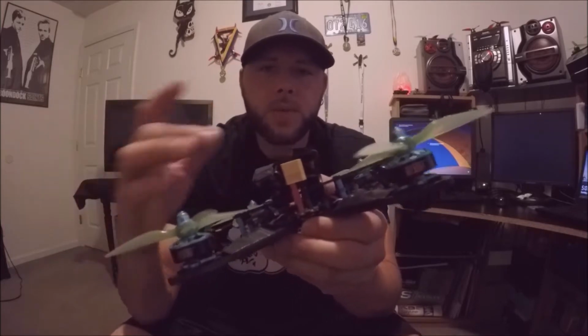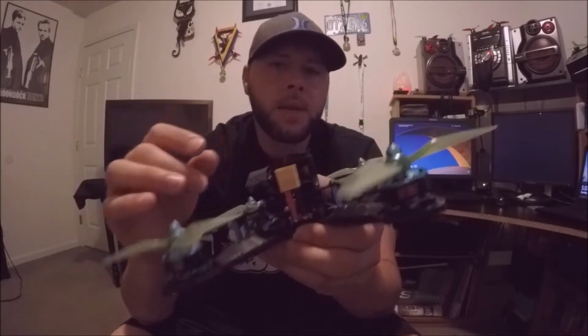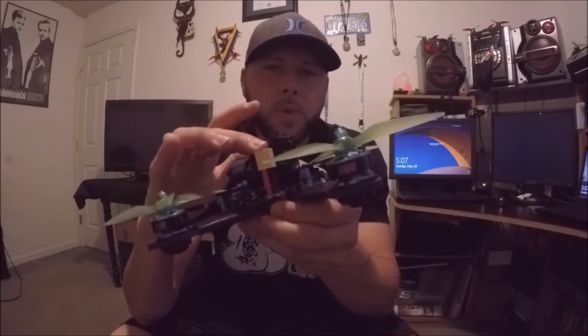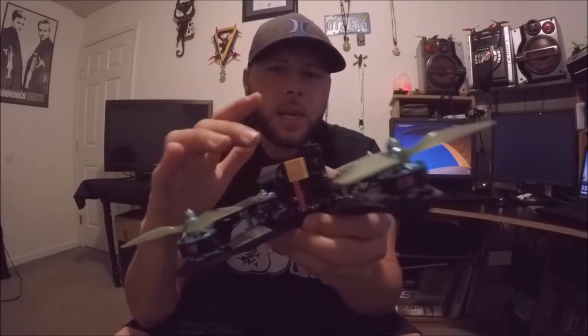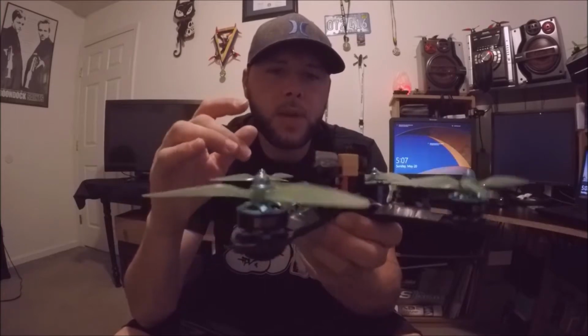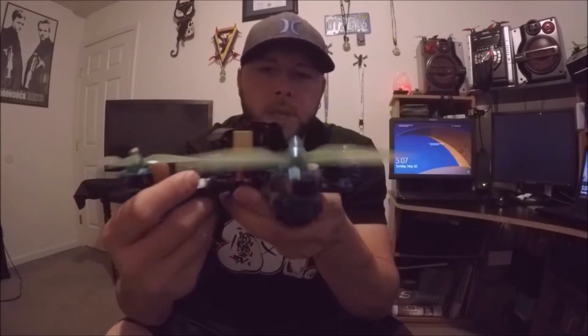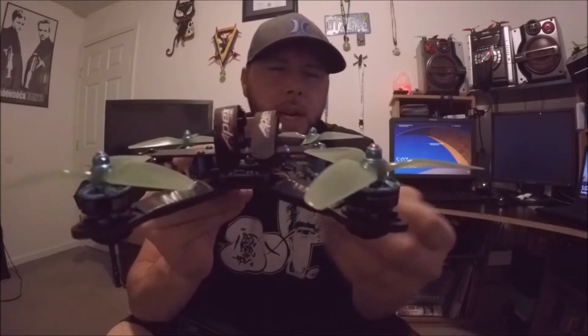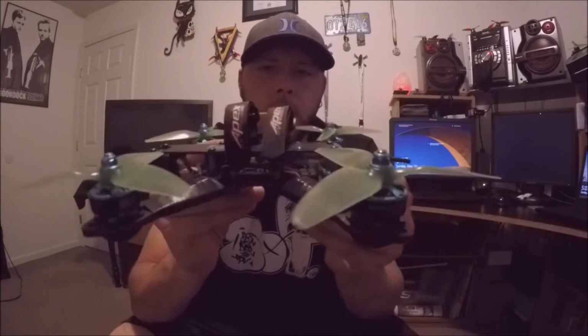If your battery tries to eject, it can put a lot of pressure on that. So again, just add a little bit of wire there, and that'll give it some support. Still a good strong XT60 connection, but I don't have to worry about it breaking my flight controller. For the receiver, we've got the FlySky, I believe it's the i6B or X6B receiver.